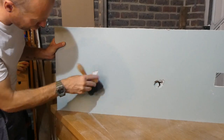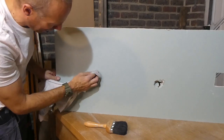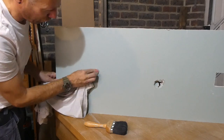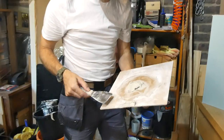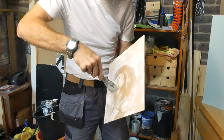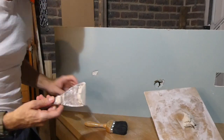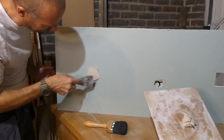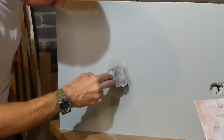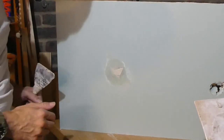What I like to do is just give it a brush, get rid of any loose plaster that might be in there, and then also just dampen it with a damp cloth — that gets rid of all that loose dusty plaster. So I've just mixed up this Easy Fix Plaster Repair. We're just going to apply a bit of this into here. Because it's a pretty small hole it's not going to need a lot. Now this product is a little bit rough, so I'm going to make sure it's filled as much as possible, not leaving too much on there, and then I'm going to skim it with a bit of plaster skim afterwards.